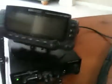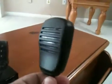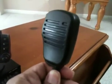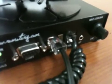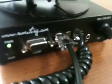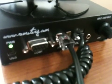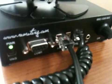The other thing I also did here is that I don't have any speakers. What I decided to do was take a speaker from a Yaesu HT — actually, this isn't made by Yaesu, this is one of those aftermarket ones. I bought it on eBay and it was designed specifically for Yaesu, but I modified it so that it's connected directly to the remote rig. I chopped off the connector and wired a modular 8-pin connector. The connection to the speaker is coming out through one of the pins that the wiring is currently not using. This remote rig is wired for Kenwood, so I'm using pin number 2 for speaker audio and just using the regular Kenwood pins for the wiring.